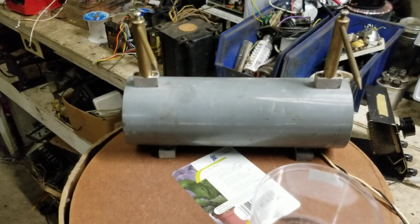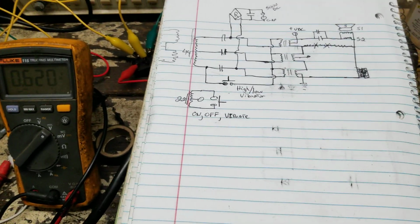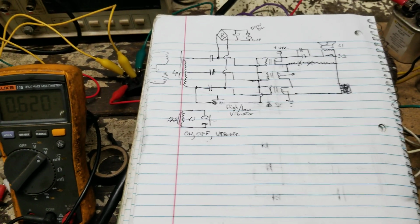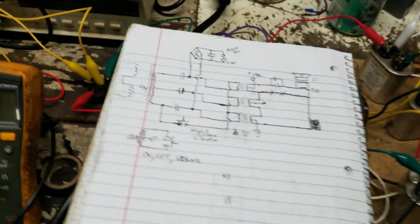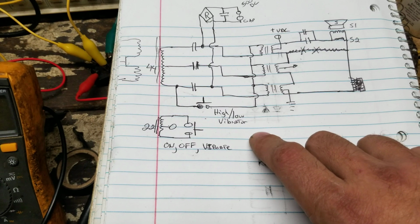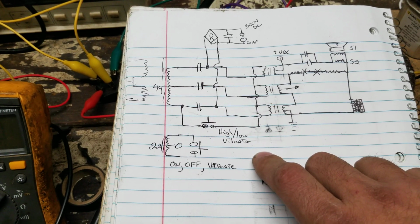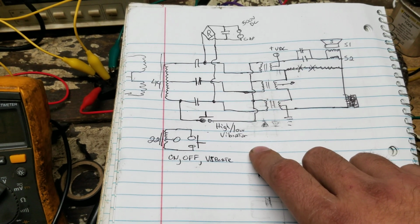The original driver for that couldn't drive it that way. Using the SCR method, the frequency would slow way down the higher the voltage you got, so it was practically useless. I was hoping I'd be able to crank it all the way up to 20 kilohertz and get 200K out, and wouldn't that be handy? But needless to say, these means are out of reach, and we have to figure out different ways to achieve them.